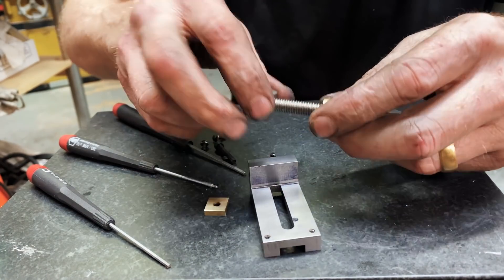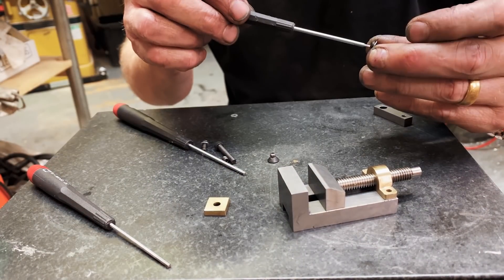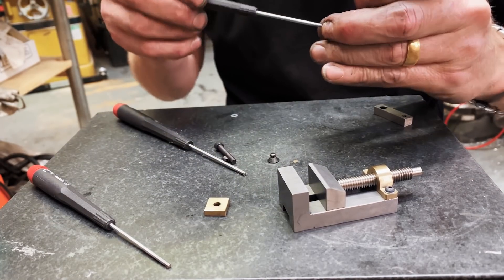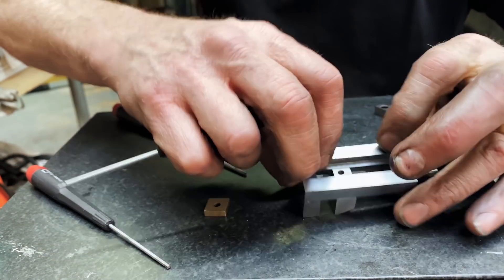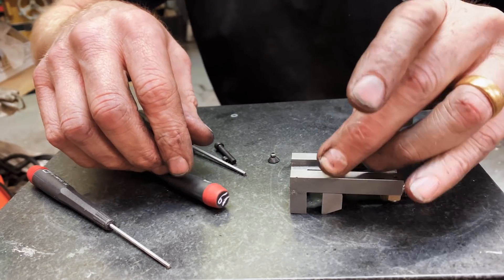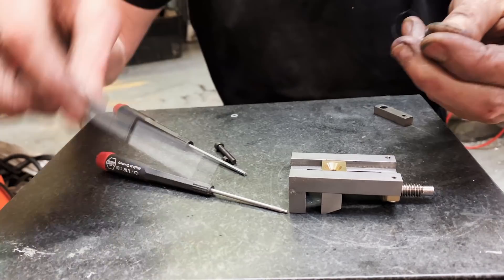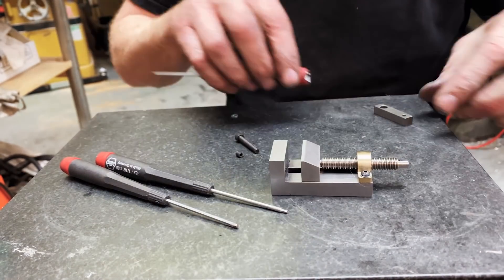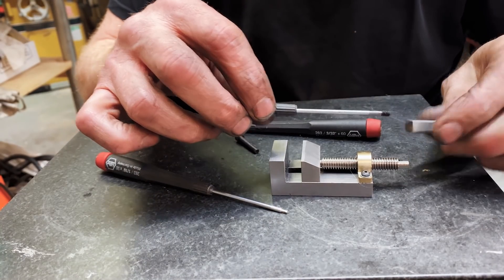Now I've got to put the threaded rod into the bronze keeper so I can put it all together. Each time I put this together I learn something different about the order of operations that is ideal. It later turned out that the bronze keeper was better in one position than another, so I put three little witness marks on its underside so I knew which way to install it. Now I'm going to put the brass keeper on the underside. With these high-precision parts that have to meet at very tightly controlled measurements, you're off by a thou and the whole thing will bind — but it's super pleasurable to dial in that last couple of thousandths so something is super smooth.